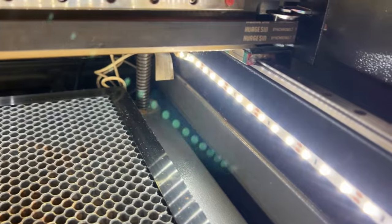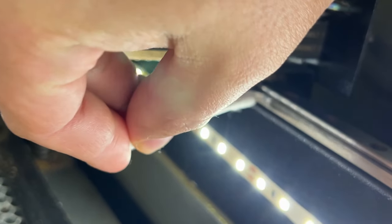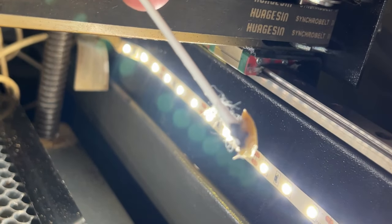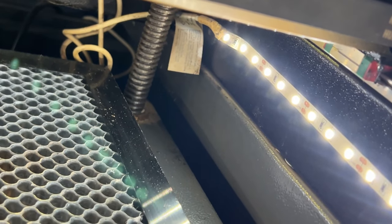After the rails are nice and clean, look under your gantry rail and you'll start to see some buildup where it slides along that axis. It's underneath the gantry so it's hard to get there with your fingers. Go ahead and use a Q-tip to wipe off all that excess right there. You'll notice there's going to be a lot of gunk built up with smoke and particle residue that combines into that lubricant.